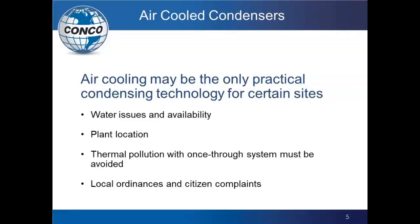Let's talk about an air-cooled condenser. One of the issues is it's not as efficient as a steam surface condenser, sometimes more expensive in many instances, and the area needed to build one is quite extensive. But there are practical applications: water availability issues — many plants want to expand but cannot get the water license to build a steam surface condenser, or they run into EPA or environmental regulations. An ACC unit is a practical way to go.